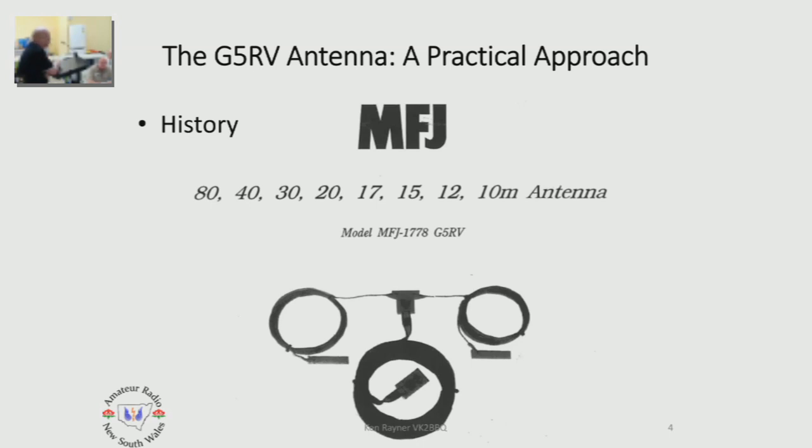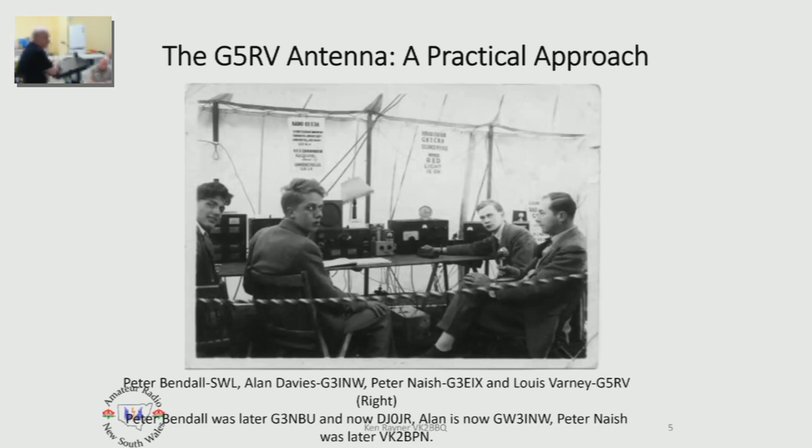He designed it because he had limited space, and it operates in a very limited space area. It is an antenna that does need a bit of height. It needs roughly half wavelength height in order to operate. So if you're operating on, say, 20 metres, it needs 10 metres in the air. If you're running it on 80 metres, then it needs a little bit more. So where I'm running it at the moment, it's probably sitting 25, 30 metres up in the air. I'm running it on a farm, so I'm stringing it up in trees for the contest, so I'm running portable.